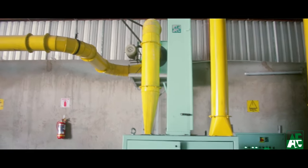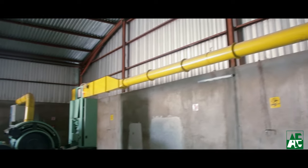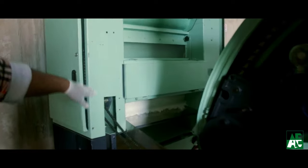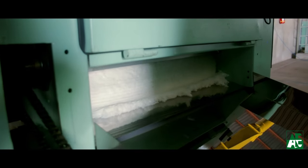The material feeding machine determines the uniform thickness of the fibers and controls the feed lattice of the six-beater machine. Two photo cells provided in the material feeding machine help to maintain uniform fiber delivery for the high-pressure chute through the material feeding fan.